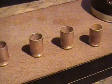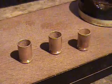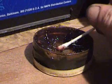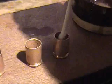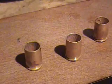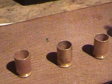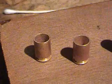There's all my cases out of the cleaning solution. I dried them and made sure the primer pocket sizzled out so there would be no moisture when I put the hot lead in. What I've got here is paste flux, and I just swab a little bit of this into the cases. I'm hoping that'll help the lead kind of solder itself to the inside of the case, to keep the jacket from separating from the lead on impact. Because if I don't, after I pour the core lead in and it cools, a lot of times that lead will fall right out. I've been doing this and it seems to stay in there, so maybe it'll retain all of its weight on impact too — I'll just have to do some testing once I get these ready to go.